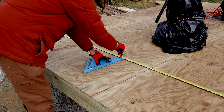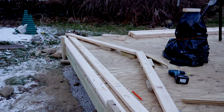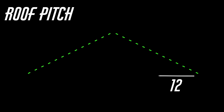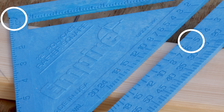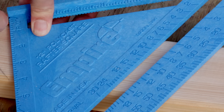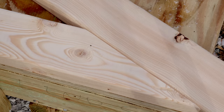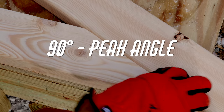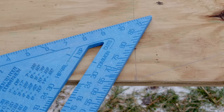To do this, you start by marking the center of the structure and then build a prototype truss so you can build the jig around that. All the trusses you lay into that jig will be roughly the same. I wanted my roof pitch to be 12-5, meaning for every 12 inches in from the edge of the building, the roof rises five inches. The easiest way to mark the angle for that is to use a speed square. You turn it from the pivot point until the common value is five, which is equivalent to about 22 and a half degrees. This measurement is for cutting the peak angles. For the bottom cord, you take 90 degrees minus the peak angle, which gives you 67 and a half degrees.